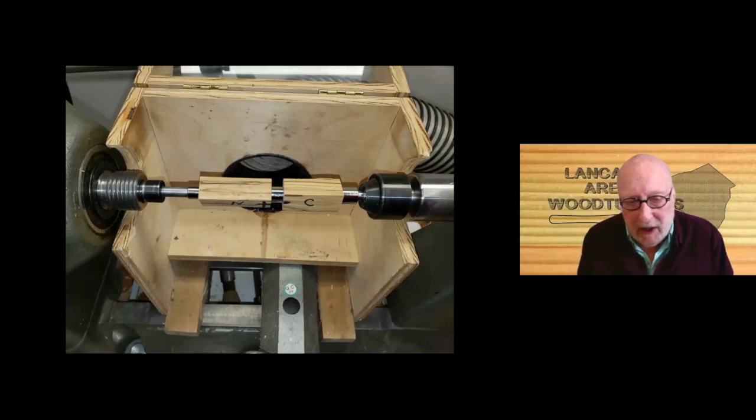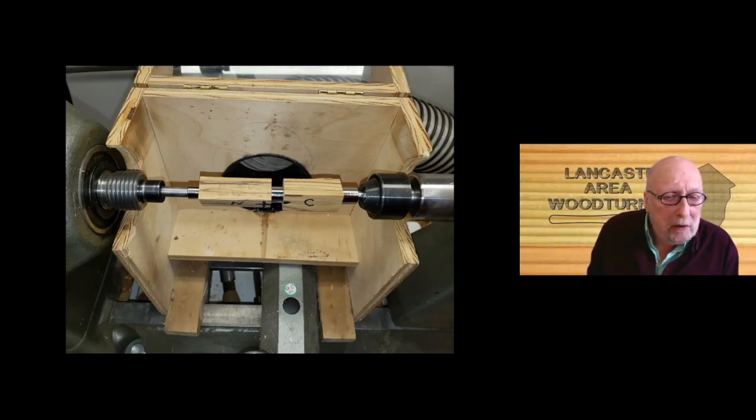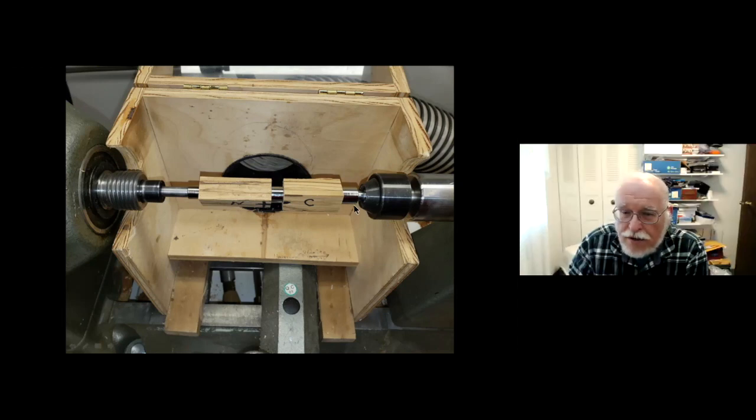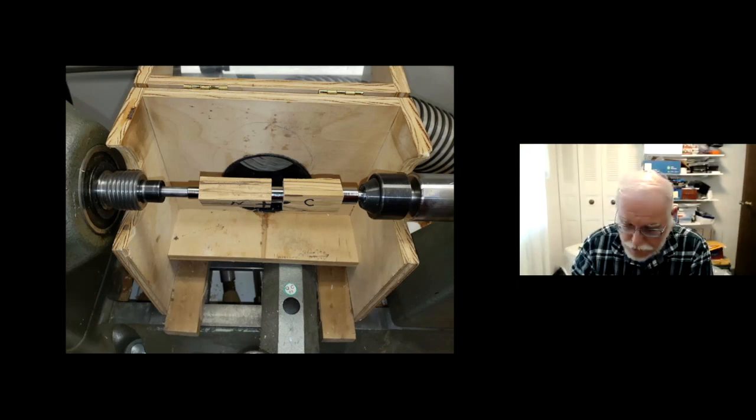What's the difference between a mandrel and a jig? It's just the name — there's no real difference. This shows the mandrel saver in operation. The mandrel saver pushes directly on the bushing rather than using a thumb nut, eliminating one more part where you could get inaccuracies. It's essentially a live center with a hole in the middle that exactly fits the mandrel — almost all mandrels are seven millimeters or 0.246 inches, D size. A lot of people like this; I don't normally use it but I have one.